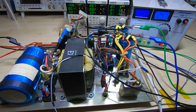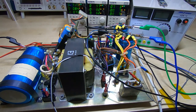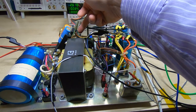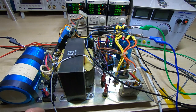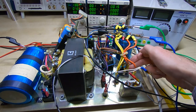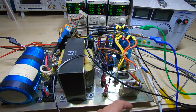I'm going to turn it off now just to be safe and check for anything getting particularly hot. There is a tantalum capacitor tacked to the back of the board down here — I will be replacing that as they are notorious for failing. I'm also checking to make sure the bridge rectifiers are very firmly bolted to the rear panel, because otherwise they will overheat. Okay, nothing's getting hot.